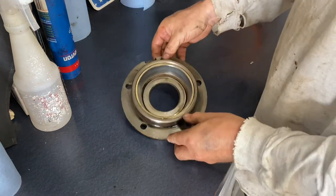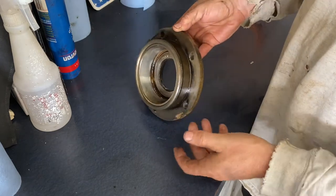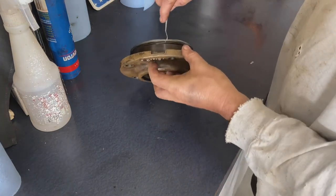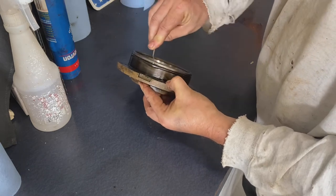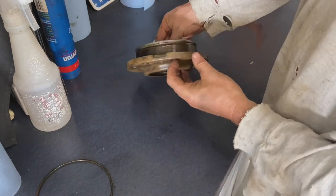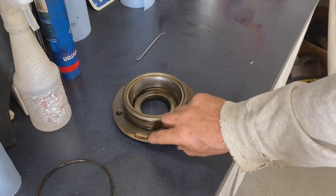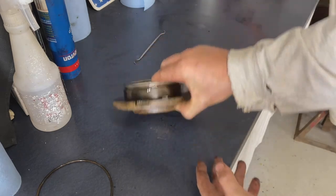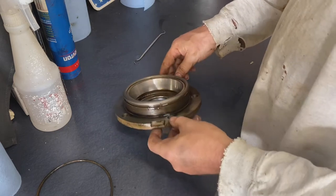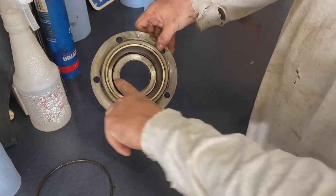All right, so this is the little housing plate that's just behind your disc brakes. So again, there's that O-ring. We'll go ahead and yank that out of there. Just a simple O-ring, easy to remove, right? And then also, just so you get a clearer understanding of those notches. So here's the notches that you're snagging from the front and back. So when I put this back in, I'll put it in a way so that these notches can be easily accessed.